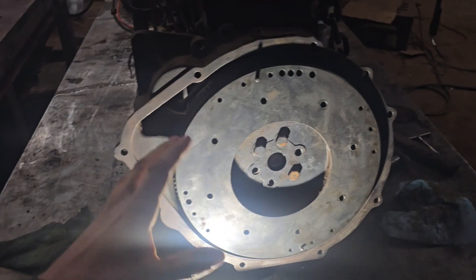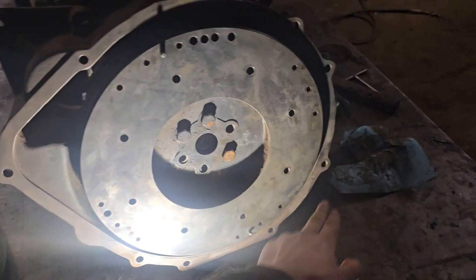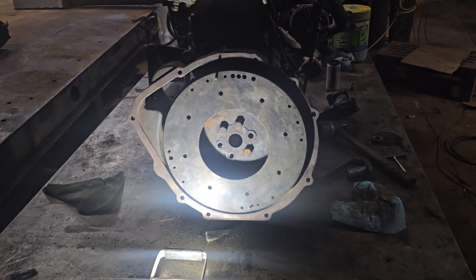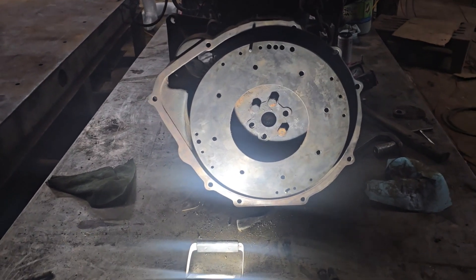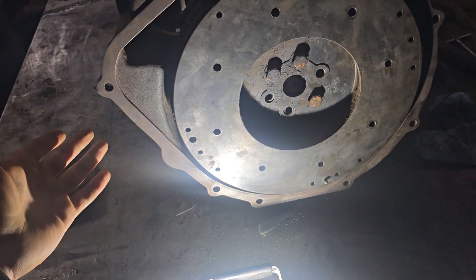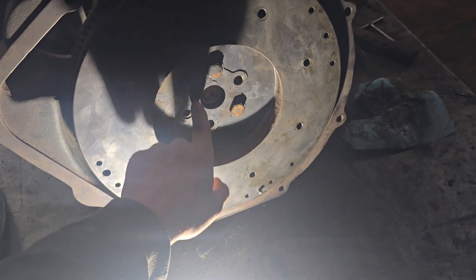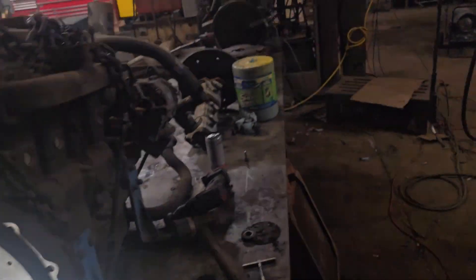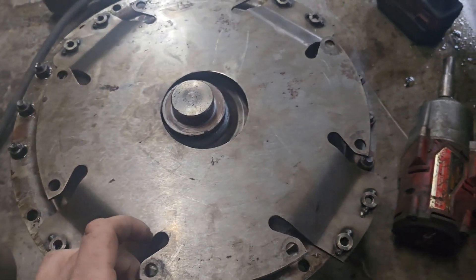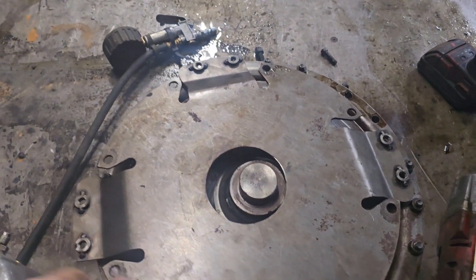The next step is to take this all back off, take a picture of it so I can get the shape, and then we're going to plasma cut out two plates. It will be a sandwich adapter plate to allow these two different engine combinations to work together. We'll also need to do some machining on the flywheel — take down some distance here to reduce it from 2.6 to 2.5 — and also machine out a cylinder for the input bearing of the torque converter off the yard crane. This plate has to get bolted to the flywheel, so we've got to put the holes in it too.